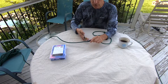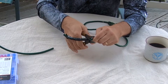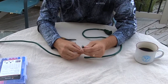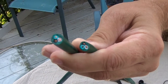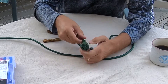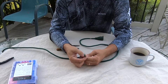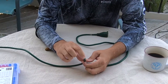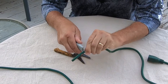All you can do is cut out the damaged portion, and that's what we're doing here. Get rid of that, and then you can see the wires — there's three wires. They correspond to the three prongs and the three holes on the extension cord. So what we're going to do is first take off the green jacket about two inches down off this wire so we can expose all three of those wires. Each side of this cord, I'm just going to cut through the green jacket — try not to cut the wires beneath it.